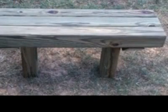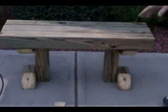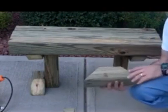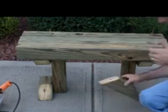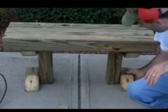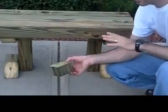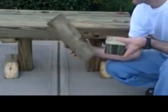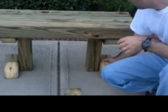So this is what I have so far — the legs and the frame and everything, and it sits pretty comfortably. I'm going to add the bottom part of the legs, making them 11 inches long. We're back on the concrete so I can keep it as level as possible. I cut my pieces at 11 inches from end to end, and I did 45-degree angles on them again. I'll drill a hole in the middle like I did on the others, put a bolt straight through, use my ratchet, and attach them. You don't have to do the 45-degree cuts — if you don't, you'll have more leftover wood for another project.